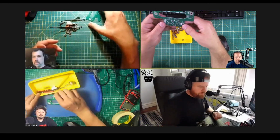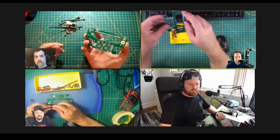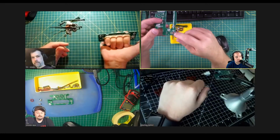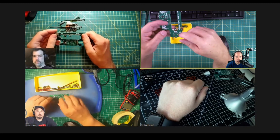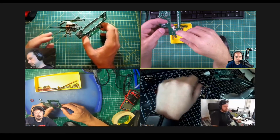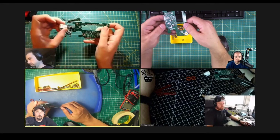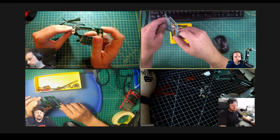So I think what happens here is you put in a 17-foot vertical wire, and then it says ground here. But it doesn't say how long of a ground or how many. I know that we took a look at the instructions, and I saw some people that had many grounds. It was 4 10-foot ground counterpoises. Oh, okay. I didn't read fast, or I didn't read good enough.